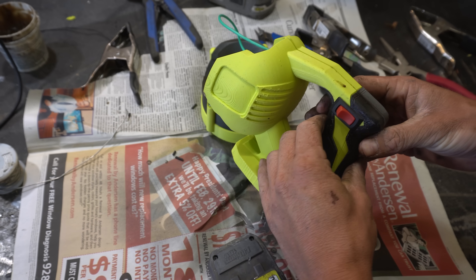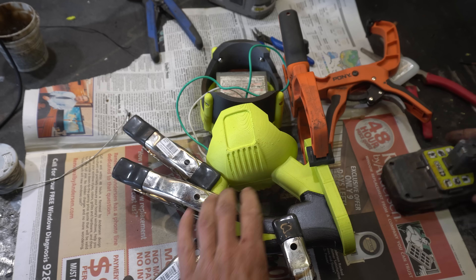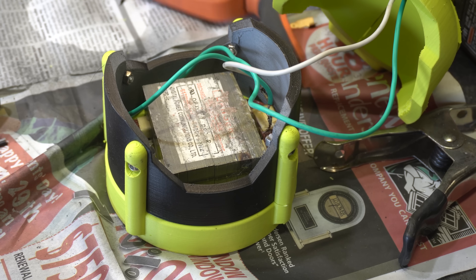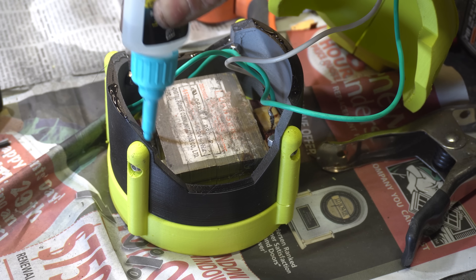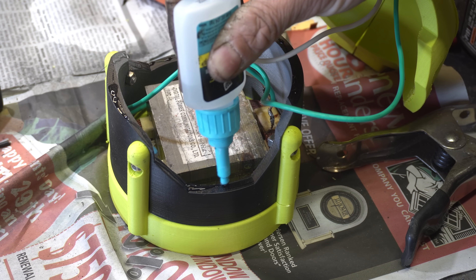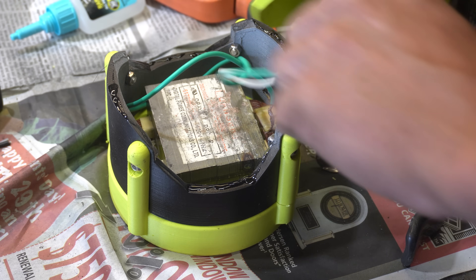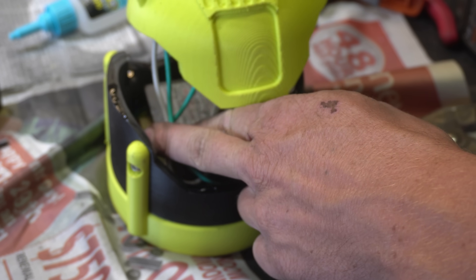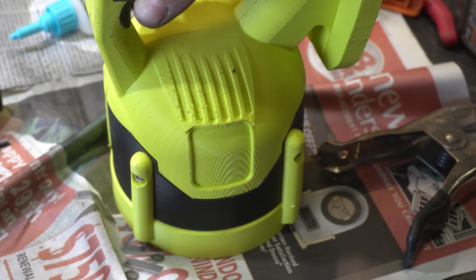We're using a copious amount of hot glue, and for this side I'm just going to tack the wire down in a couple places using hot glue to make sure it's running through the track where we want it. For the other side we've already got our contact hot glued in. Then we take our wire straight from the battery contact and solder it to the switch, and the other side of the switch gets soldered to the wire that goes to the transformer. We make sure the wire is running in our little wire channel, then we just got to glue these halves together.